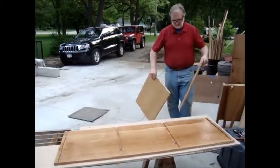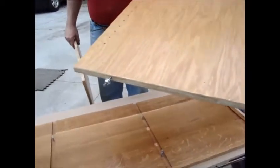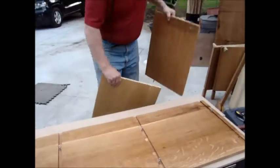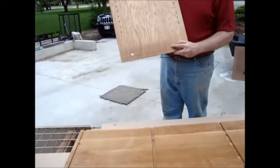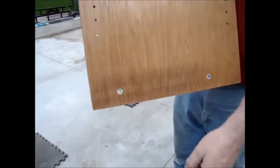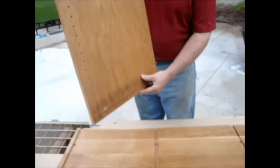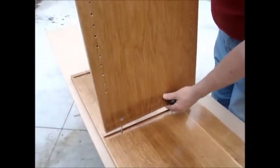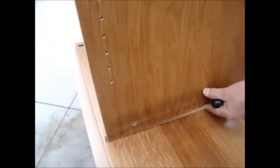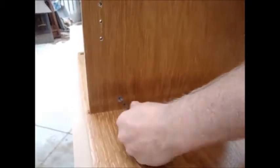Now the dividers, you can tell that they're dividers because they have this little screw on the bottom. And you notice these connectors here. These are called cam connectors. These are what actually connect to those little studs down there. You need a standard screwdriver, not a Phillips screwdriver, and you set it up so that these cam connectors are facing towards the center. And this just kind of slides right in there. See that? And then you just lock it, turn it, and tighten.